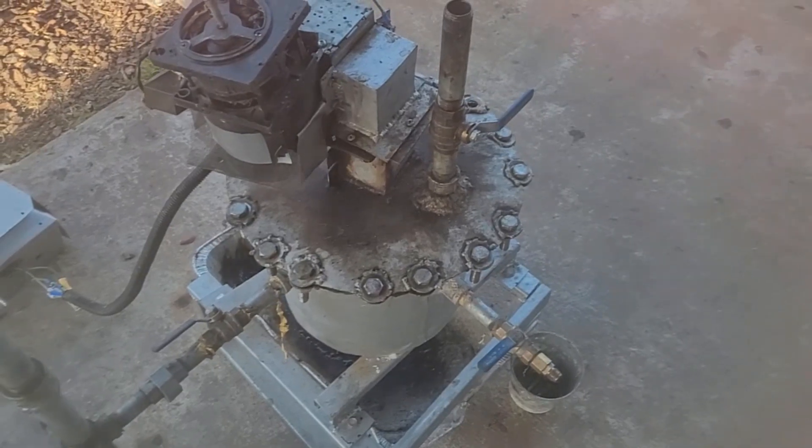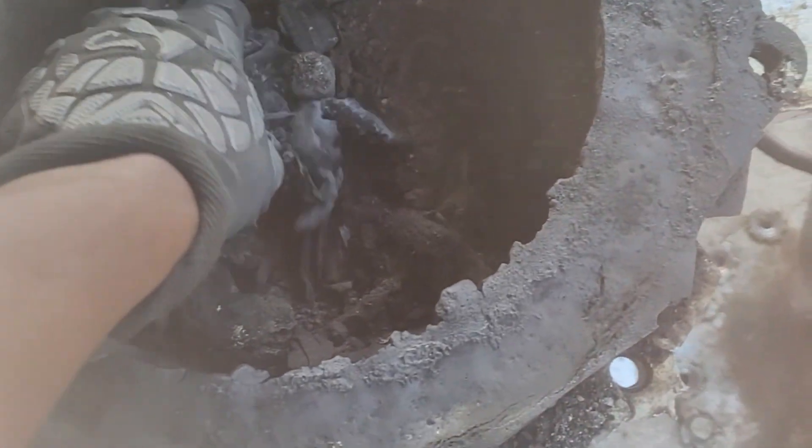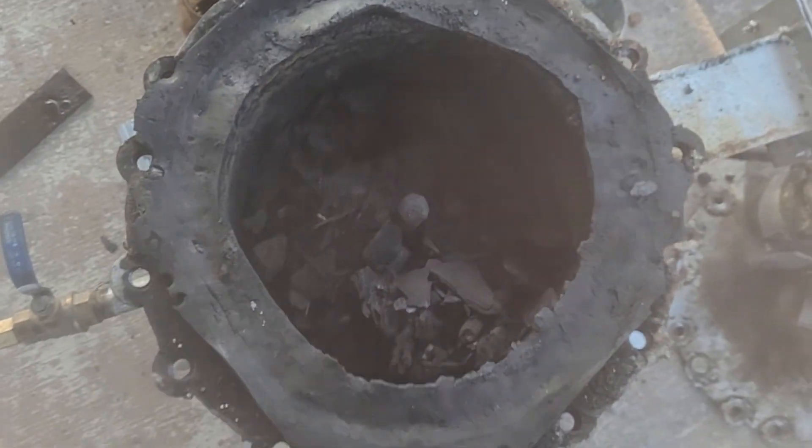Next morning — let's open her up and see what she looks like. There we have it. Very good carbonization. I love the sound of when something is carbon — it almost sounds metallic. You can see they still retain some of their shape, but since it's carbon at this point, it's very brittle. This is biochar. We made biochar, but we also got energy out of it. Really nice even carbonization. The very bottom wood chips did not break down — I kind of expected that. Since we don't have agitation in this reactor, the microwaves can't go down that deep to the very bottom.